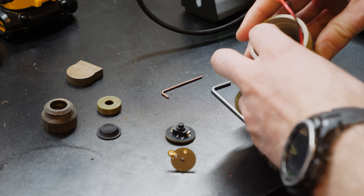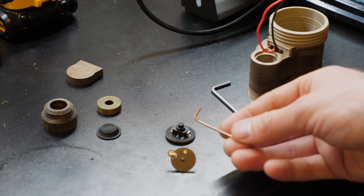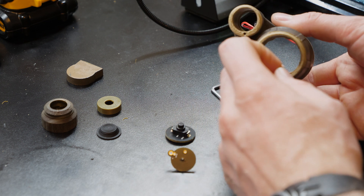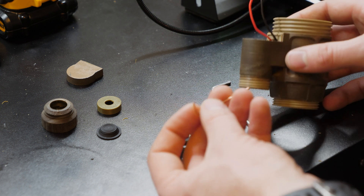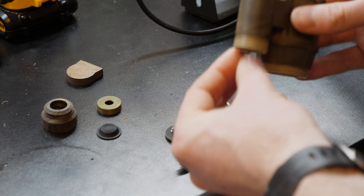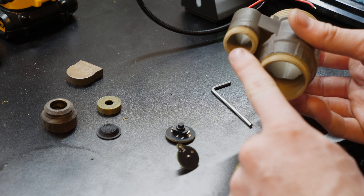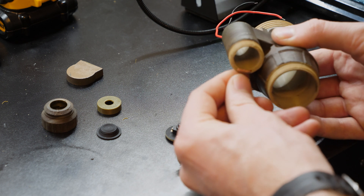The next piece I didn't quite understand was how this piece of solid copper wire fits into everything. There's actually a channel that runs from the front of the battery compartment to the back of the battery compartment. You'll take this solid piece of copper wire, just stick it in there so that there's a little bit sticking out the back. Then you'll want to bend it 90 degrees and flatten it out with a hammer or something, just so there's more surface area and it's more flat.